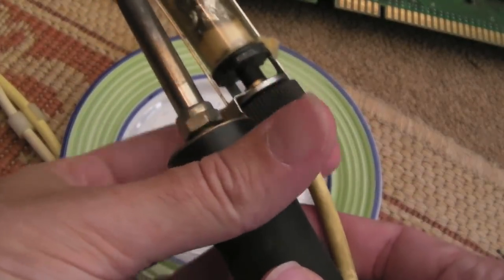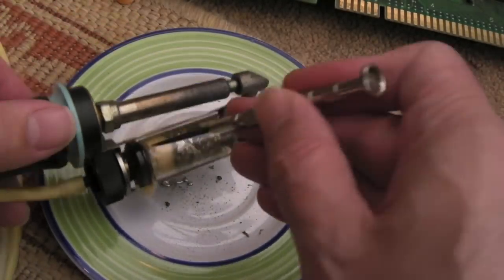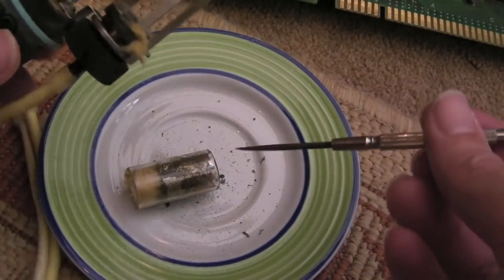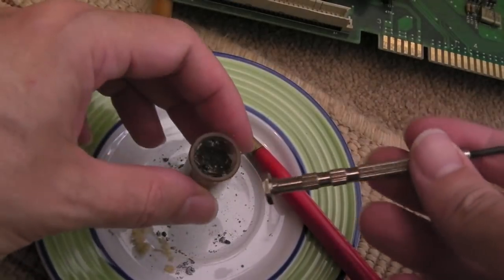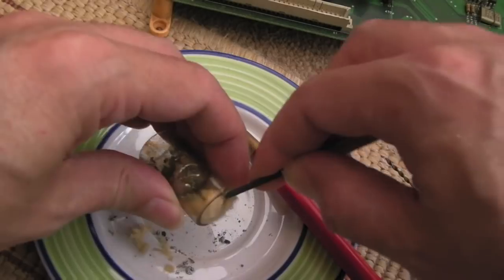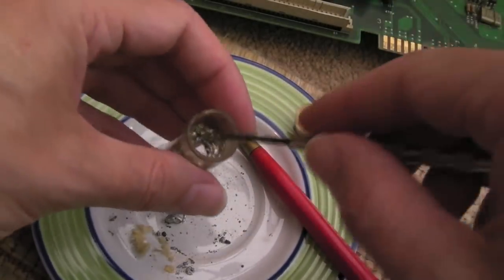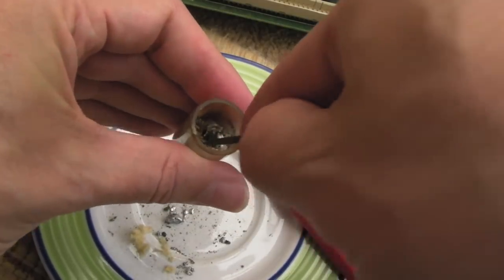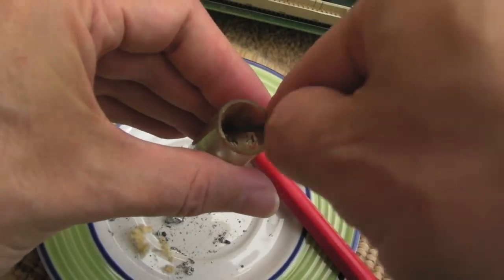That seems to be unblocked. The way I normally do this is take a plate - I'll set the temperature - and carefully pull the glass out, then leave it to cool for a minute or two. Now that's cooled down, we can pull out the filter. You can see that side's clean and that side's pretty much caked. With a gentle push it starts to come out - solder is primarily lead so it bends pretty easy, it's quite malleable.